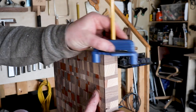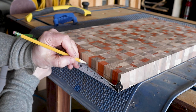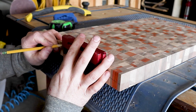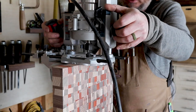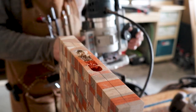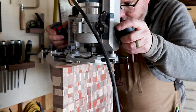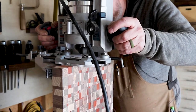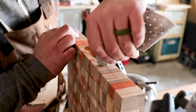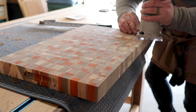My thought was to make this a two-sided board, so I decided to put recessed handles on each side just so it'd be easier to move around. I measured in about four inches from each end to determine the handle size. With the cutting board standing vertical in my vise, I used a half-inch round nose bit from Bits and Bits to add the integrated handles, taking very small passes to prevent kickback and minimize burning — though I probably could have prevented some burning by turning the router speed down, which I only realized during the voiceover.